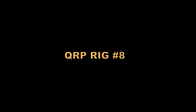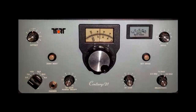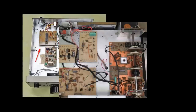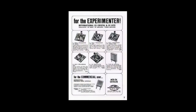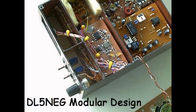Number eight is the first attempt at QRP in a commercial radio: it's the Ten-Tec Century 21. Now wait — wasn't the Century 21 70 watts? Well, 70 watts was QRP in the 1960s. This was a complete solid-state radio dedicated to the CW operator alone, and it was a big hit. Note the modular nature of the build — individual modules tested before integration. This style was pioneered by companies like International Crystal and carried over into reference design boards from places like Analog Devices and Texas Instruments today.